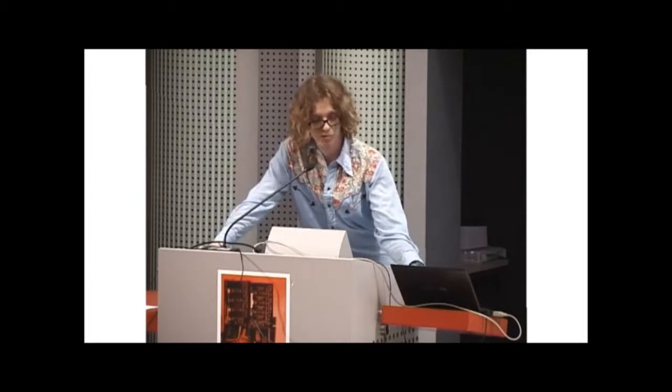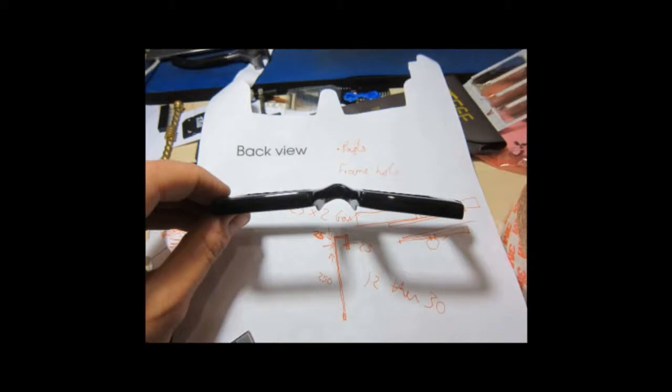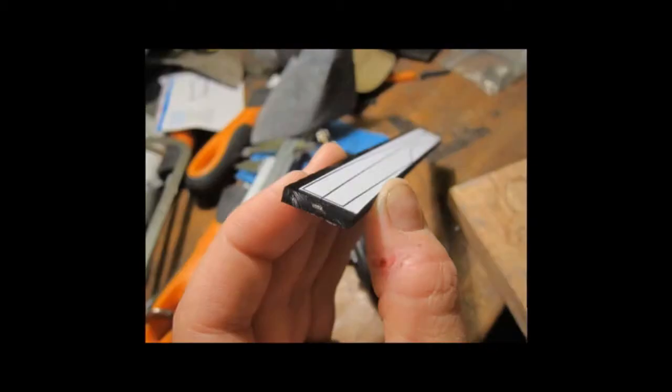That's what it ended up like after all the sanding, filing, and polishing — I forgot to take any photos of that because I was enjoying myself too much. Also, the thermoforming characteristic: I wanted to give it a nice curve to fit around your face, so I heated it up with basically a big hair dryer and draped it over a piece of wood that had the right curve cut into it. You can see the little channel — now it's got the laminated sheet over the top so it's a tunnel connecting the two sides. For the temples — the arms of the spectacles — I found there are only two or three companies left in the UK that still make spectacle frames this way.